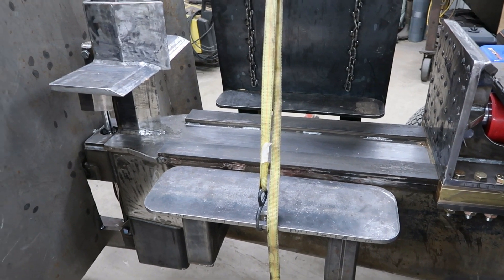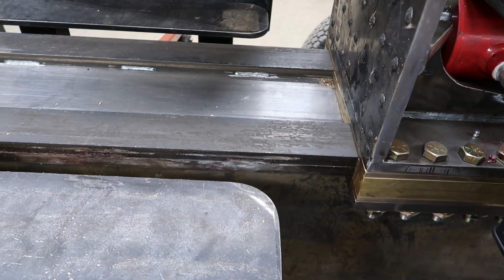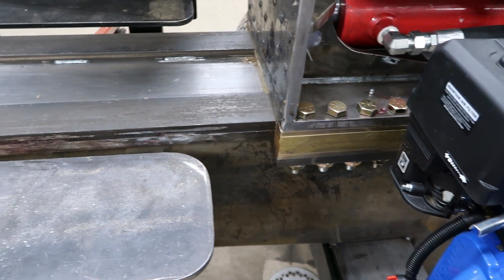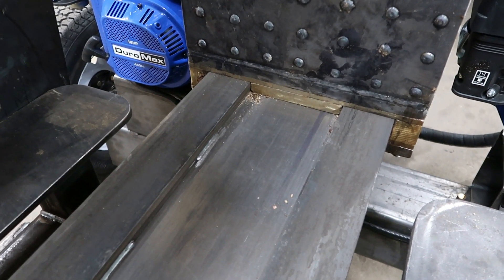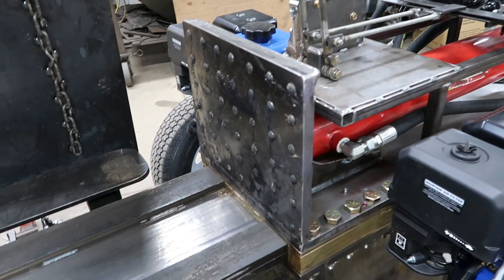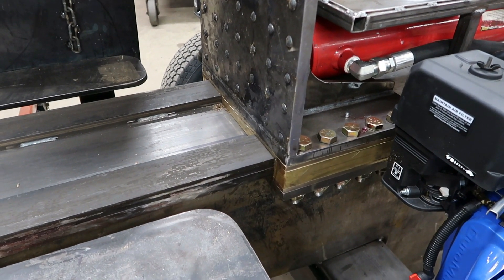Building this from scratch, I had a couple more ideas. The top plate is three-quarter inch, and I added another three-quarter piece — two things: it gives more surface area to resist twist, and it's what the brass and bronze can ride against. It also develops a cradle for the wood. The top is 12 inches wide, the whole plate is 15 inches wide, 12 inches high, 12 inches long, with three-quarter-inch bolts. All bronze and brass, inch-and-a-half on the sides.